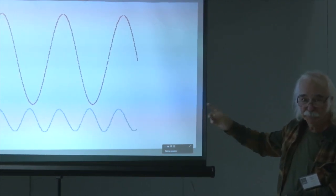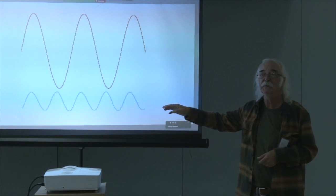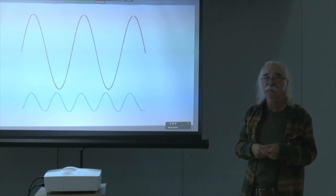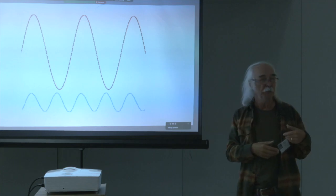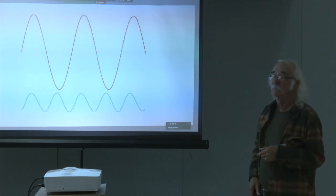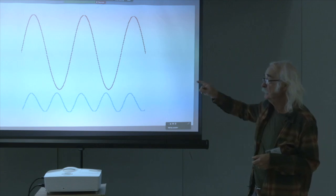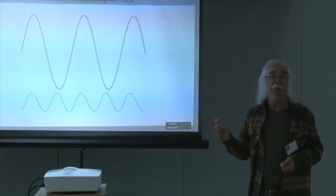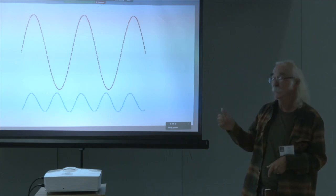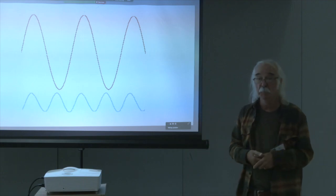Oh, there's that sine wave again. Now, this has not had the phase flipped on it. In other words, this is what they do, and in the case of the Korg, there is no additional, the Korg itself being a common cathode operation inverts the phase. Common cathode, like with common source on transistors, is both voltage gain and current gain, and inverts the phase in so doing. If you want your phase to be corrected, you flip it at the speakers, or you flip it electronically before the speakers and after the preamp. So that's one of the things about the Korg that you want to remember. Now you can run it the other way. It'll just sound different. You might like it better. That's a possibility.